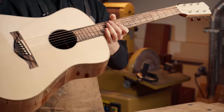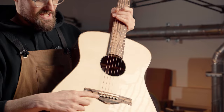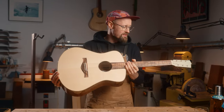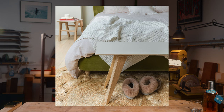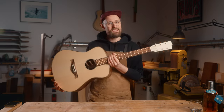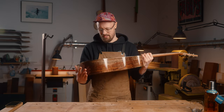We've got some pear green purfling, but the really interesting and cool thing about this guitar is the pistachio linoleum that we've used on the headstock and the back of the headstock, and on the heel cap. I've even included it on the bridge pins and on the inside of the sound hole. If you've watched my channel for a while, you know that I'm all about colour and texture and material choices — the inspiration actually came from some bedside tables I have at home which had this beautiful mid-century inspired aesthetic with a furniture grade linoleum for the tops. I thought, what would that look like on a guitar? And I went and did it and I'm really glad that I did. It's the kind of guitar I'd expect to see in Don Draper's house on the set of Mad Men. I just love that mid-century aesthetic — the colours and textures, it's my jam.